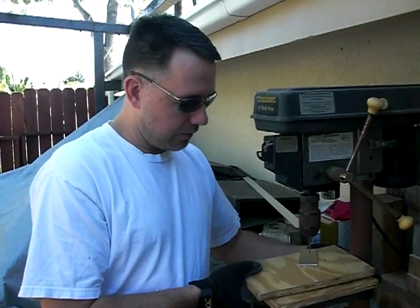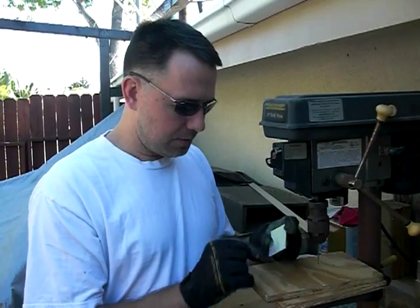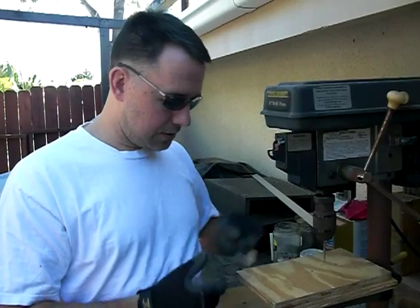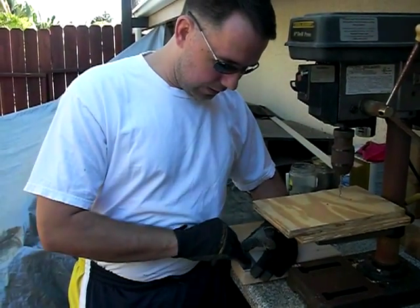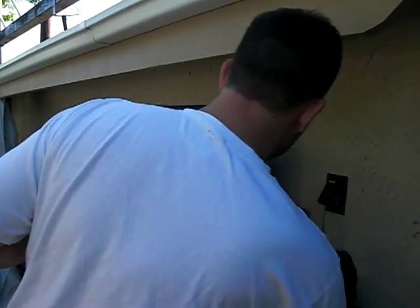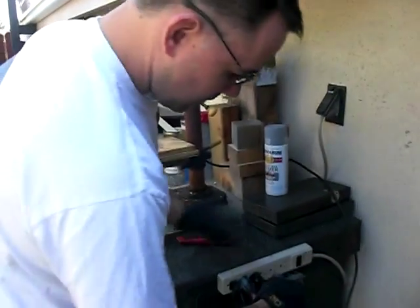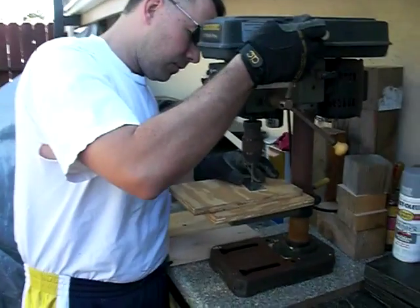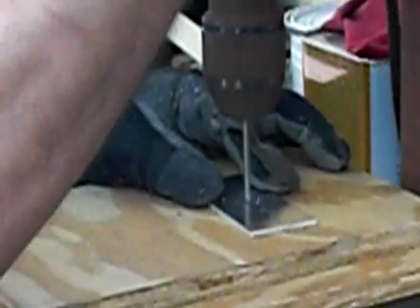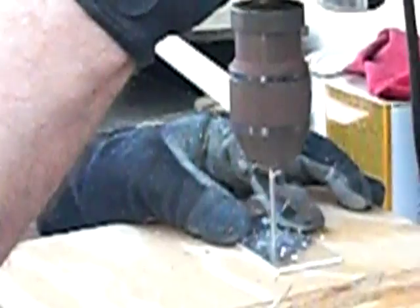You want to get your drill bit about a half inch away from your material. Raise that up, lock it in, and there we go. Make sure you've positioned your hash marks correctly. I'll drill one now and then one in the center — I usually drill three. When using this on a 2x4 you'll only use the two on the outside, but on some occasions if you add a third screw you might use that. Make sure your drill press is plugged in. You just want to slowly plunge through the material, tap it lightly once to make sure you're on your center mark, then make the plunge slowly. Let the drill do the work — don't force it. There it is, there's one hole made.